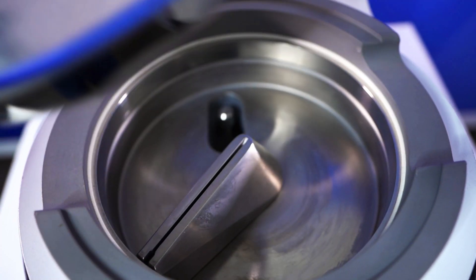Since the E200 LS sieves one screen at a time with the ability to break up agglomerated particles, the Alpine is extremely accurate. As long as the material types and representative samples are the same, you'll yield repeatable results. But repeating the same results with previously tested materials is more tricky — the undersized particles that fall through the sieve are carried into the vacuum and later disposed of, making running the exact same material twice kind of impossible. There are peripheral devices like the Cyclone that will collect the fine materials after testing, which can be added to your E200 LS to remedy the problem.